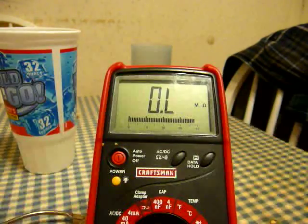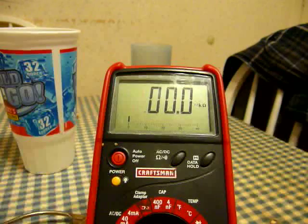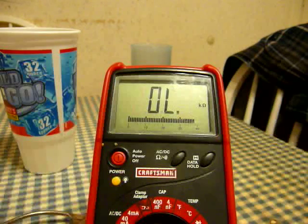Here's the test. We'll take these test leads and put them across each fuse. Test this one over here first — that one's definitely good. Now, a fuse that passes a multimeter test won't always work in circuit, because sometimes a fuse can become intermittent, but it's very, very rare that that should happen. As you can see here, there's a very low resistance condition across this fuse, so that fuse is good. Let's check the other one. That fuse is open loop — that fuse has definitely blown.